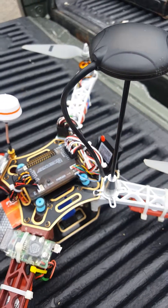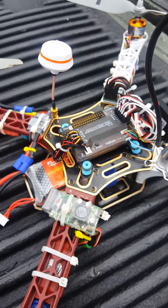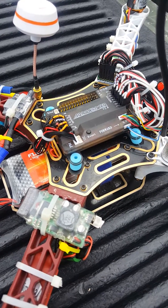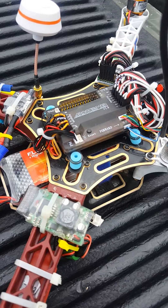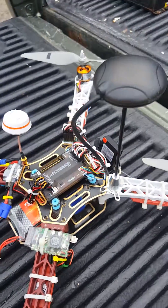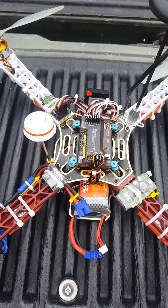So I chose to use the external compass instead. You still have to go into Mission Planner and select external compass and calibrate it. I did want to put a video out telling people that the i2c port can be used for the compass, but you'd have to solder the pads — why do that when you have the mag port available right below the GPS port? Hopefully that helps somebody, because I could have used it when I was configuring.